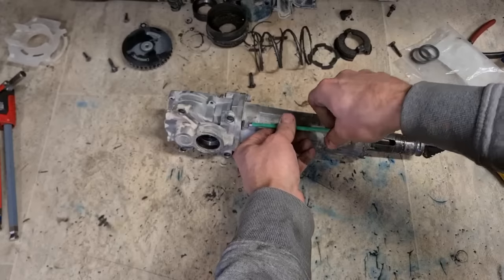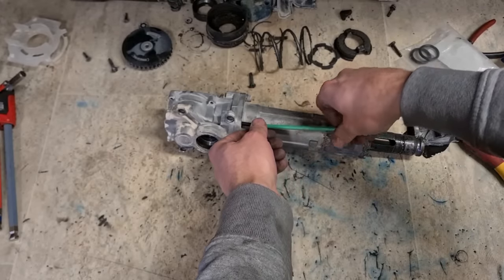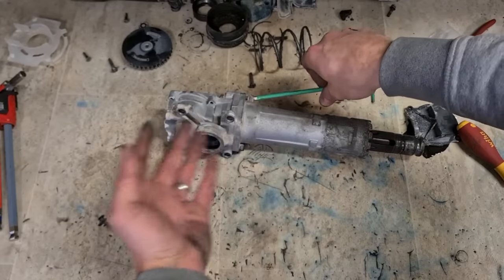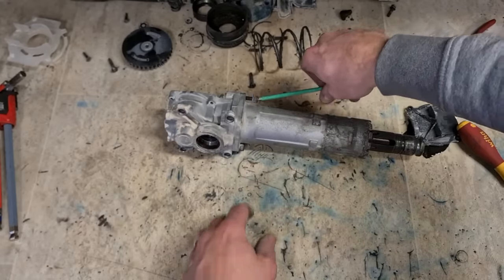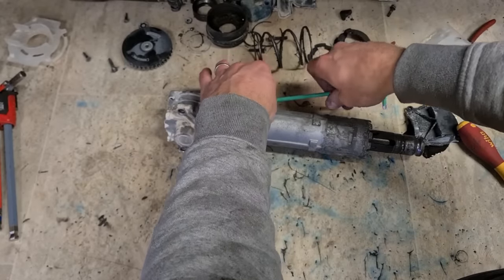What happens is they start being used for work they're not supposed to be doing. Kango under demolition or something like that. Maybe even just taking tiles off a wall, but they'll be using it for the entire day, not giving the machine a chance to cool down at all. And that's when the motor starts giving trouble.